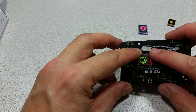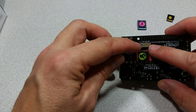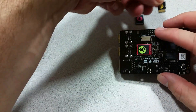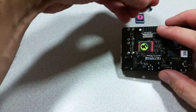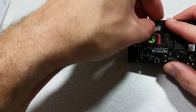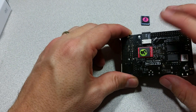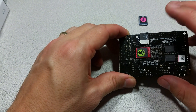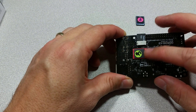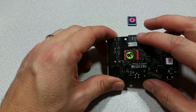Now we can also look at the micro SD port. If you look here, there's an outline of the way the micro SD should be inserted. You'll notice there's a keyhole on the micro SD, so we have to flip it over and insert it. If you have both the eMMC and the micro SD inserted, the board will boot off of the eMMC if there's a bootable operating system on it — the micro SD will then be used for storage or for access.